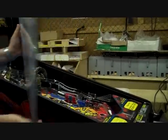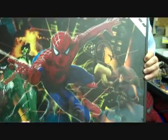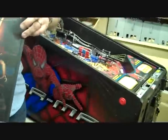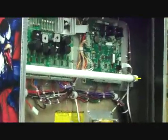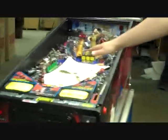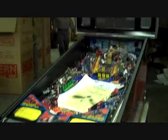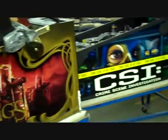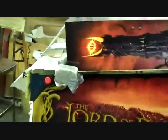We have the back glass. Made on a polyester material, printed UV lithography, 175 lines, and it's held together with glass with the channels. At which point the instructions are put in, it's all cleaned up, and the dot matrix display has different languages in it. French, English, Spanish, German, and Italian. We also have different instruction cards in the different languages as well.